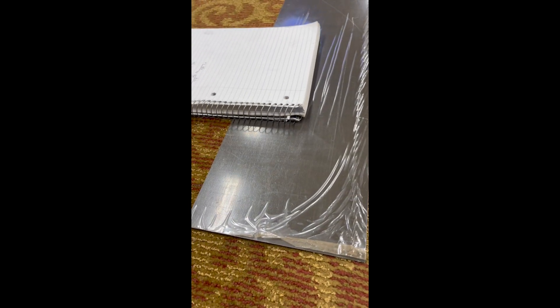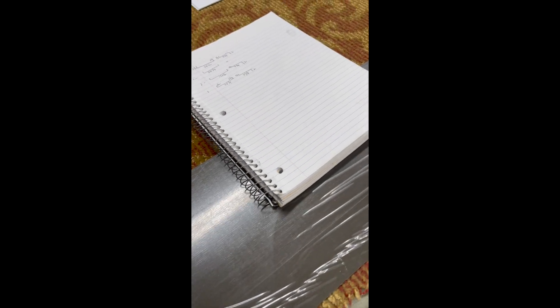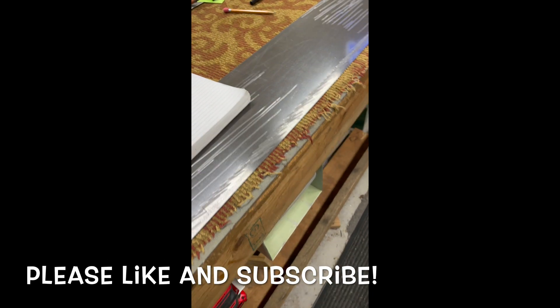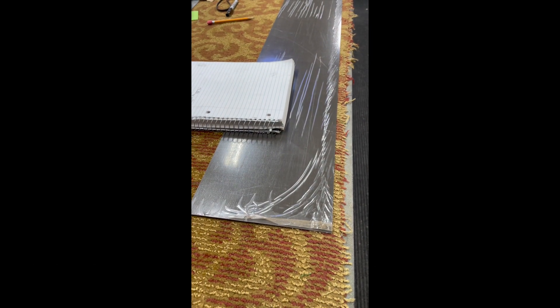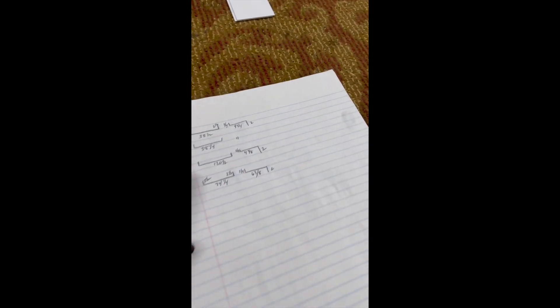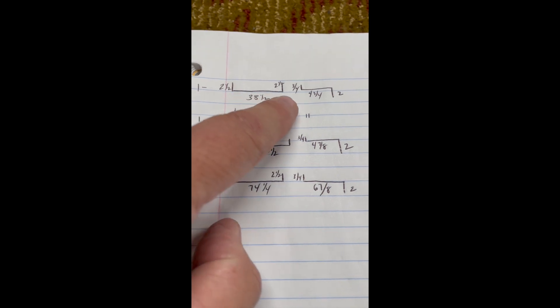Welcome back to the 509. I got an order from one of my customers this morning for five door pans. Door pans are a type of flashing you put on the frame of the door jamb before you put your pre-hung door in. They're designed in a Z-shape so water can't get behind it — and if it does try, there'd have to be a lot of water to bypass that. This goes underneath the door, hangs out in front, and the width goes from corner to corner, with the sides raised about two and a half inches on each side.